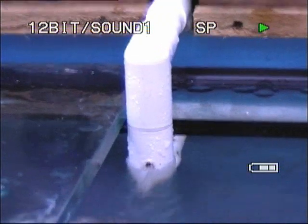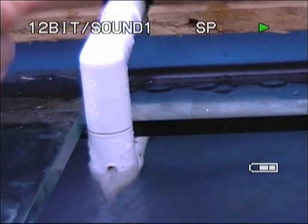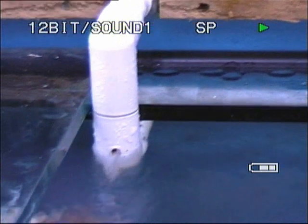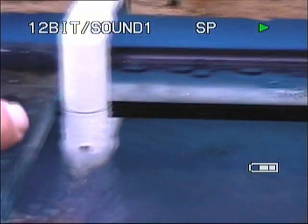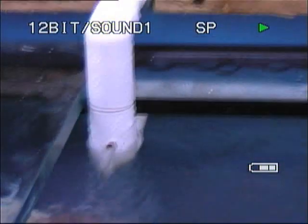What happens is when the power is cut, instead of pushing water out of there, obviously the water stops. Because this pipe is full of water, it falls back down at the back of the tank. Now that wants to pull water out of the tank, so that hole there sucks air in — air gets into this bend and cuts the siphon.